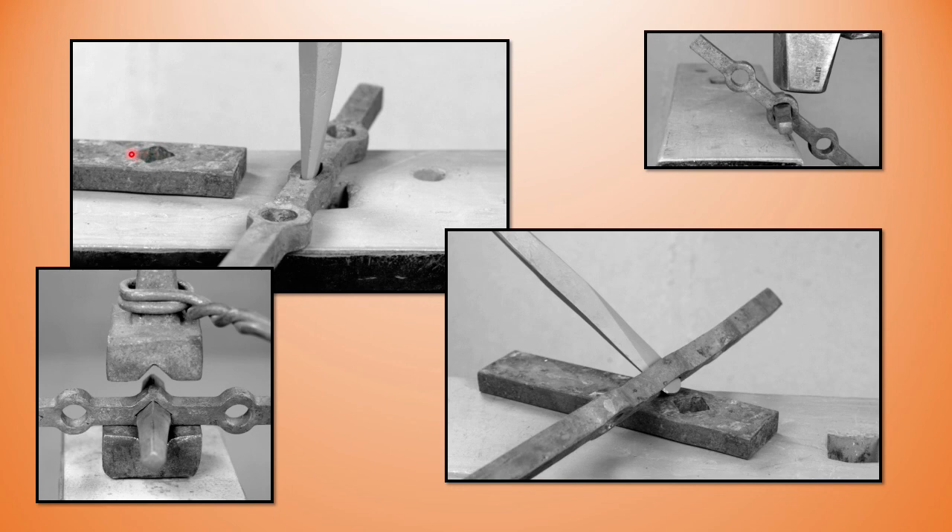I'm looking at the diagonal measurement for my slot punch: for a half-inch hole, that's typically about three-quarters of an inch. You can add a sixteenth if you wish — I typically don't with diamond ones because I'm relying on that corner cutting a little bit, so I'll go to spec at three-quarters. With the drift — note the corner we labored to keep, with the two sides uniform — I drift over the hardy hole first, and as soon as the drift has come through the other end I reach for the bolster and continue to work from both sides. This is a precision fit: I work a little from one side pushing material to the center, turn the bar over, work from the other side pushing material to the center, and try not to let any excess material come out past the edges of the bar.